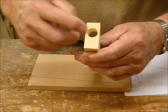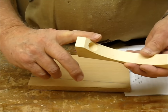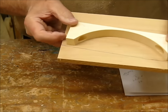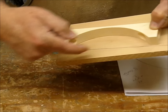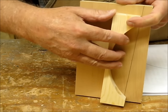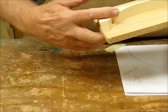Now I've drilled my 5/8 inch hole in each end. There's something you have to bear in mind: you need to have these holes drilled at about a 4 degree angle so that they're facing up towards the center of your cutout. The way I got that to work out on the drill press was I had a piece of wood and marked a 4 degree mark on the side of it, lined it up with one side. Then, to get them exactly the same, I flipped it end for end and lined it up with the 4 degree mark again and drilled the other side. By doing that, you get an equal amount of degrees of angle on your drilled hole. That's pretty important to make this work.